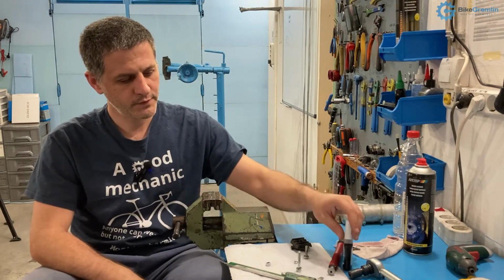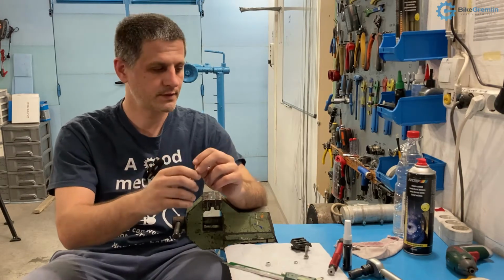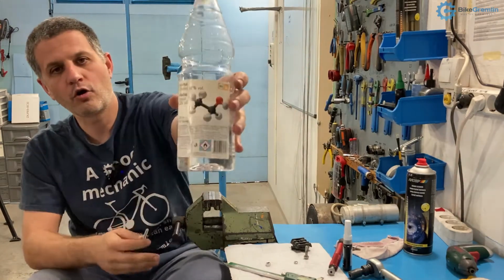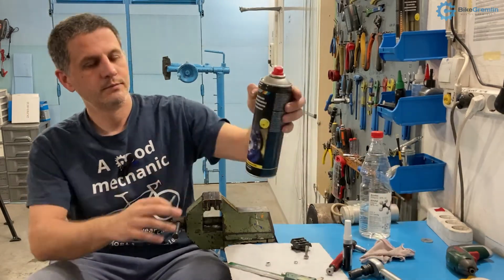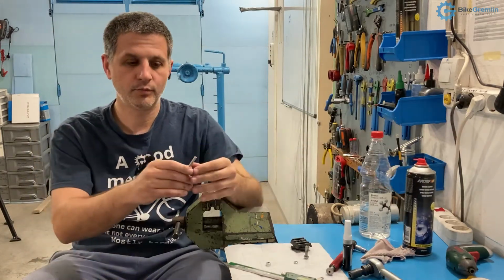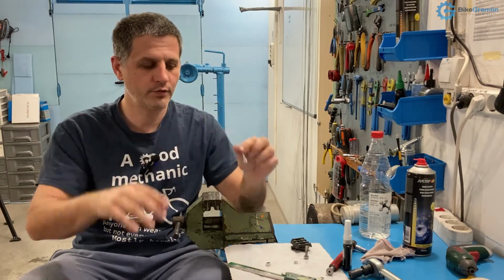Well, the first thing is to make sure that everything is clean, no dust and no oil or grease. So you can use some 90+% alcohol for cleaning it with some cloth that is clean, or use some brake cleaner. Make sure that everything, both the bolts and nuts and wherever the bolt is screwed into, is clean and free of any oil or grease.